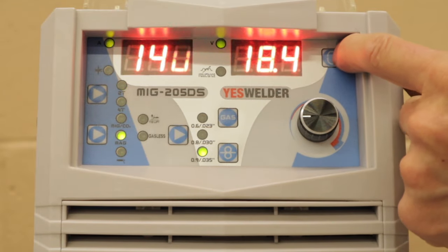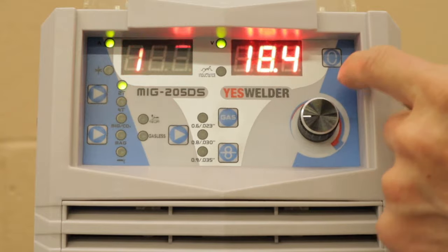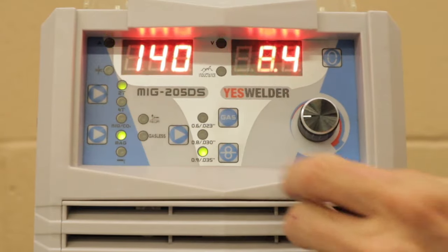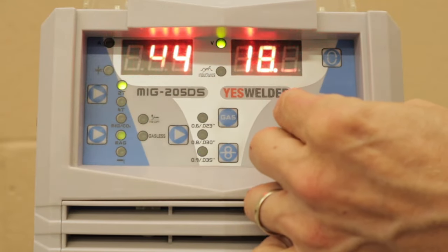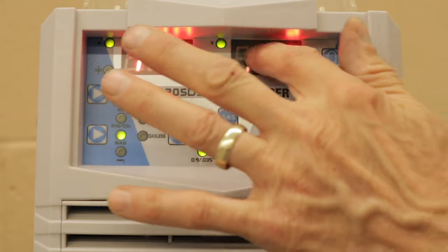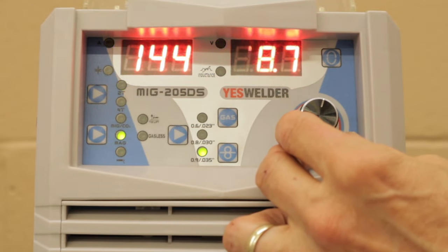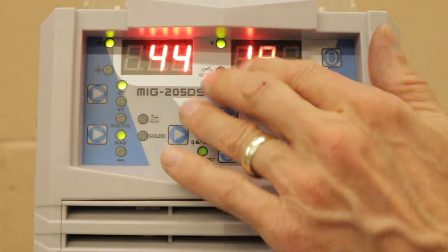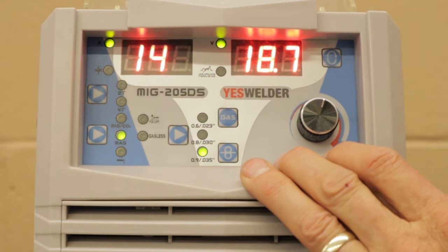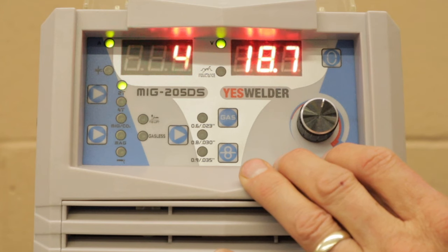All right, this is back to our selector button. If you don't select anything, when you turn the knob, it'll adjust your amps. So these are your amps over here. These are your volts. For 99% of the welding I do, I've been using this welder, I only adjust the amps. And I have a chart that I'll put up, and I'll give a link to it in the description.